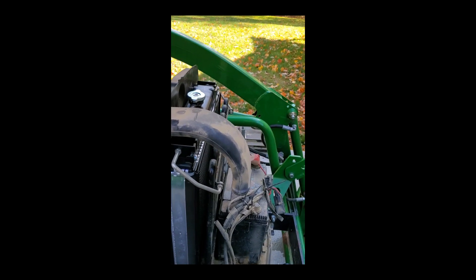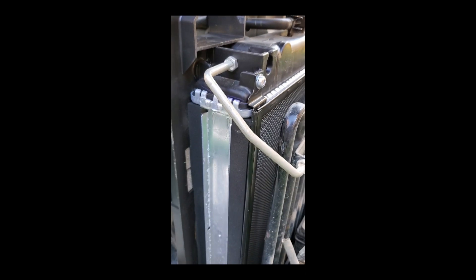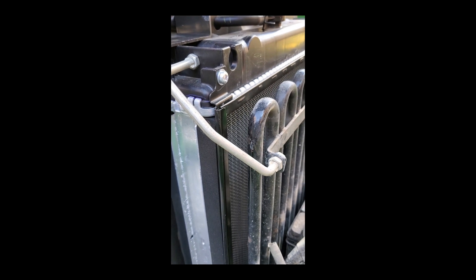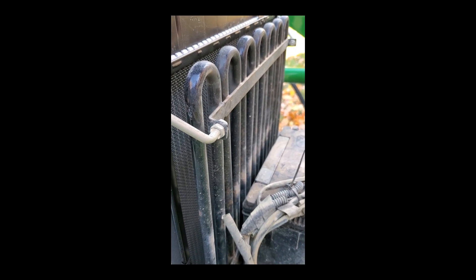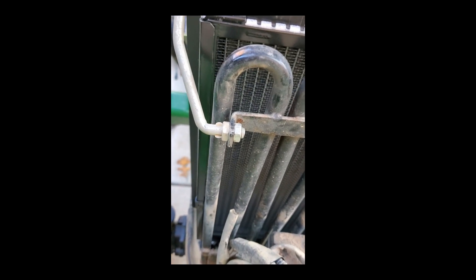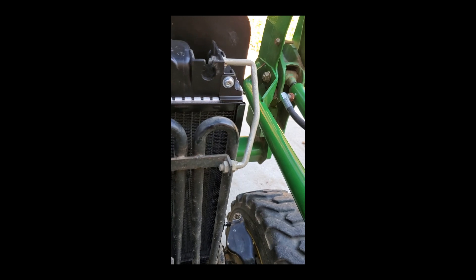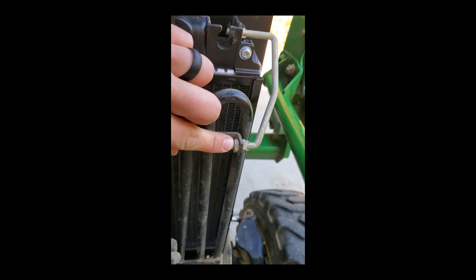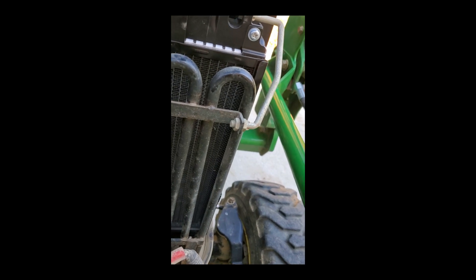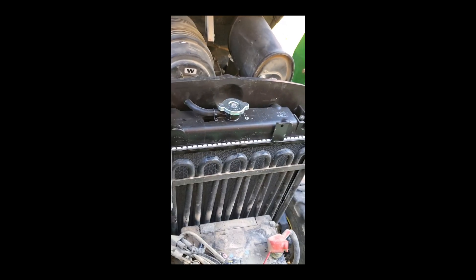Move to the front side of the machine. On the front side, both left and right, we have these bolt bracket mounting arms — it's kind of an awkward design — and what these are doing is basically holding it to the coil system here. All you're going to have to do is loosen up the nut on the back side. You can actually leave it attached; just loosen it up to where you can get some room, then remove one completely and pull it off the radiator — that's going to allow the radiator to come free. Do the same on the right side: loosen one up as far as you can, take the other one all the way out, and these things will just pull out and rotate and you can let them hang. At that point, we have the radiator completely detached from the machine.